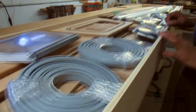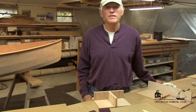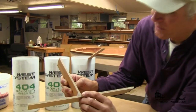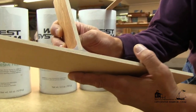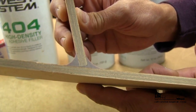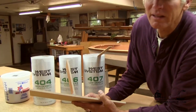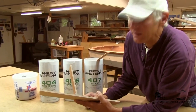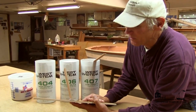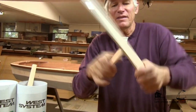We sell kits for wood epoxy boats, and the thing that our clients have the hardest time with is the fillets. What is a fillet? It's basically a way to tie two surfaces together, whether it's a bulkhead to a hull panel or a deck to a hull — pretty much anything. And it's very structural. It's basically like welding — you're welding two pieces together, but instead of working with liquid metal, you're working with liquid plastic. Just a little bit of glue can make it that strong.